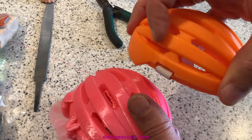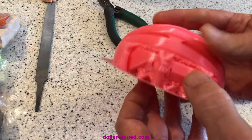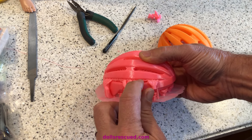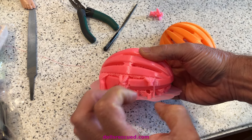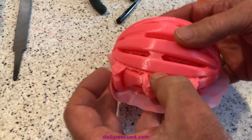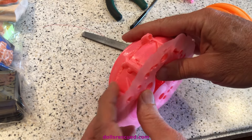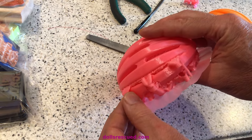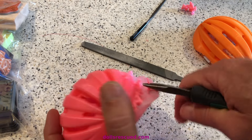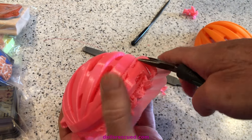For example, on the bottom of this helmet there's an overhang — a big bridge here in this hole. When it's printing this piece of the helmet, underneath has no support, it's just printing in mid-air. So the slicing software adds all of this foamy material here — printed loosely but enough to support — so you can remove it. It creates a rough texture underneath and you have to file, cut, or live with it.